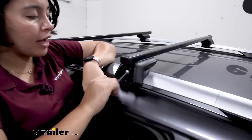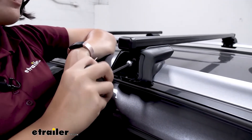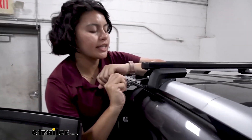This is going to be a 5mm hex wrench or allen key, and this allows you to tighten down your bolts without fear of over-tightening. And once you get to 4 newton meters, you are going to hear a clicking sound.